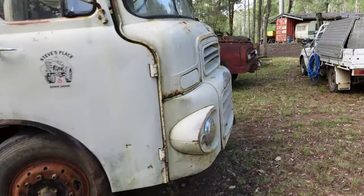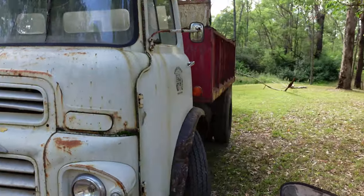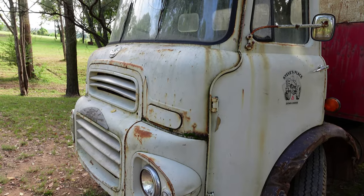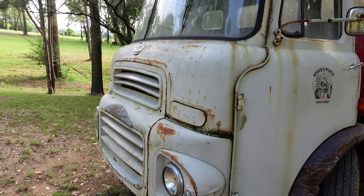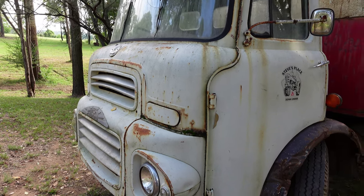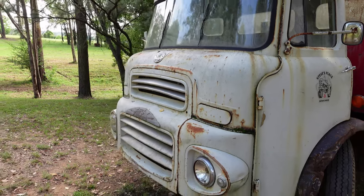Okay, she's going obviously. I didn't film the bleeding process because it was down beside the engine there and there's no way of getting the camera in there and myself. So the top of the inline pump was full of air, which it always is for some reason. So could even be a check valve in the lift pump letting it run back, I don't know. But it's going now. I might just give the windscreen a wipe over, then we'll go and get the loader going.